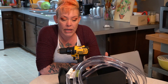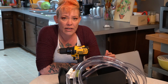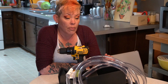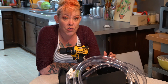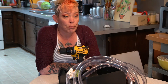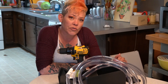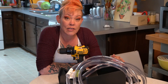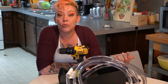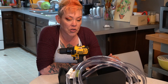Let's start with discussing what a weir actually is. Technically, a weir is a dam used in a river to moderate flow. In a pond application, it is used to moderate the flow of the filter — often as part of a bog filter — and to calm the flow of water from very large pumps into a less turbulent environment that allows for good plant growth as well as the peaceful nature for a lot of the fish kept in ponds.